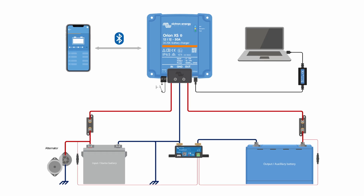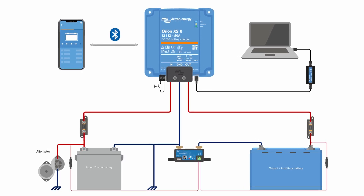We need to think about what's going to happen if those lithium ion batteries see a condition they don't like and the battery management system disconnects the battery from the boat. Is it going to destroy the alternators? Is there some other battery in the circuit that will stop that from happening?